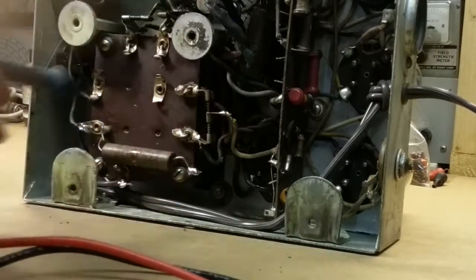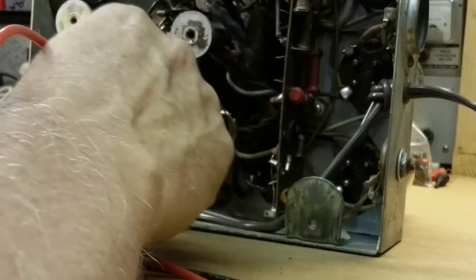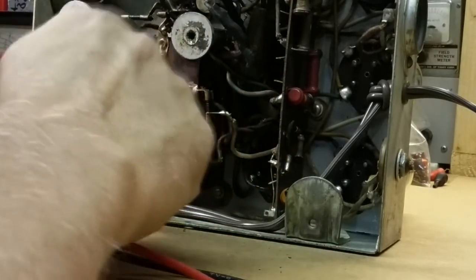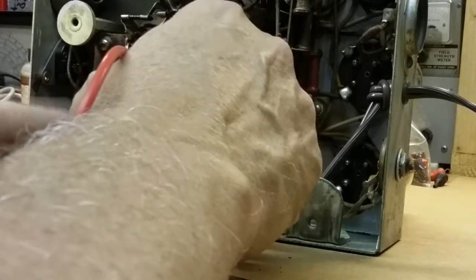This funky one. Let's go across it. Okay. That coil's fine. This coil's fine. This looks like it. And that's just an input wire for the coil, and that's the other side of it. This is the line cord input. So that's the primary of the transformer. It's fine. This, I believe, is just ground. Yep. So the next one.